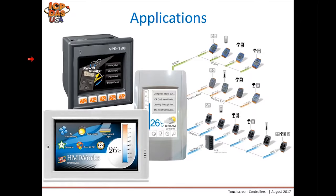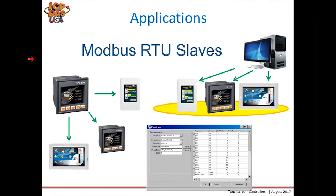The TPD and VPD can also act as Modbus RTU and Modbus TCP slaves — you just must select the appropriate version. Note that at least the TPD-280U is required for this; the TPD-280 and 283 don't have enough memory currently, but most of our TPDs do have this feature.